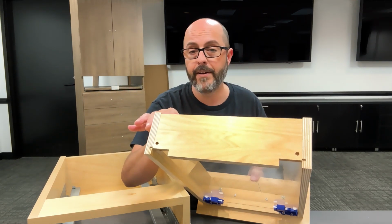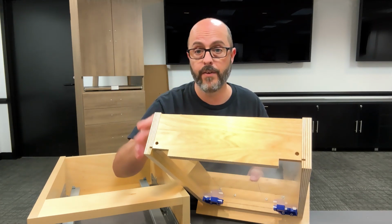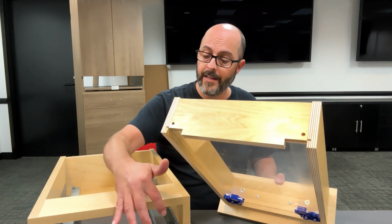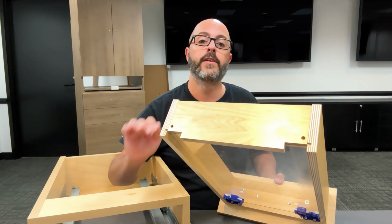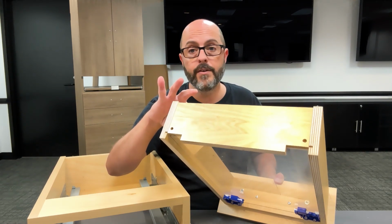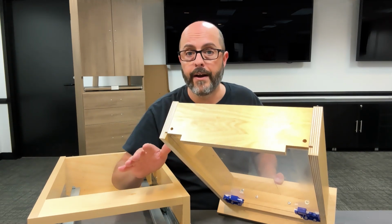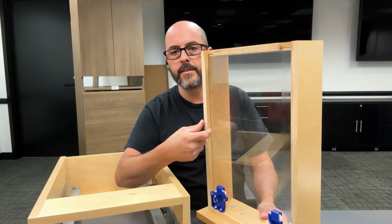Now, cut that out, 8 3/8, put your sides on. It doesn't matter if they're 1/2 inch, 9/16 or 5/8 inch sides, as long as they're somewhere in between 1/2 inch and 5/8 of an inch, it will work perfectly with your undermount slide. So once again, measure your opening from left to right and then deduct 1 5/8 of an inch. It'll work every time, no matter how off your material is, because sometimes you buy 1/2 inch material, but it's really 7/16 of an inch material. Guess what? Doesn't matter.